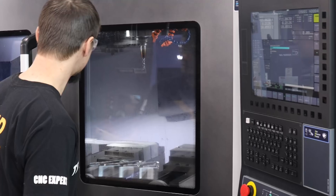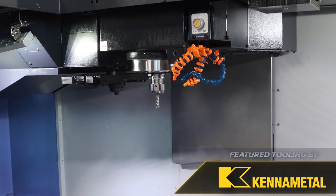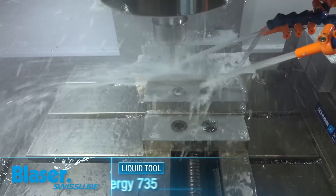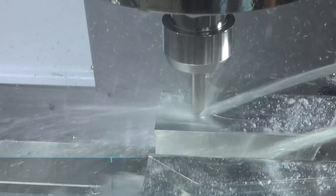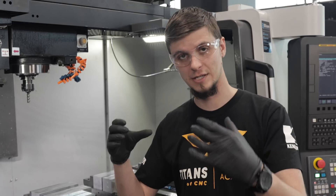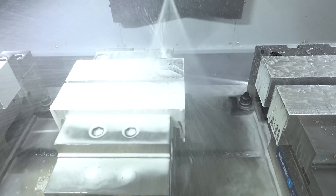Just like that I deleted my vise. I'm now going to take my program, rearrange it, and move my stuff around so I can get it perfect. I got my Core 5 in and I'm now ready to cut my soft jaws. I went ahead and cut about 20 thousandths in Z for my profile into my soft jaws so I can make sure the program is positioned correctly and that my soft jaw will be in the right spot. Since everything looks perfect, I'm going to lower my Z so I can cut the pocket.